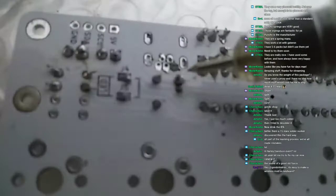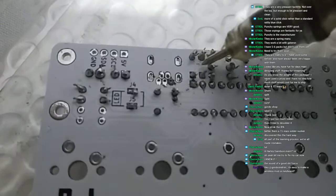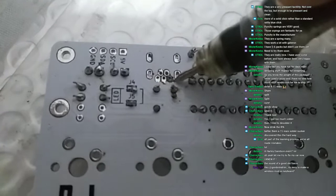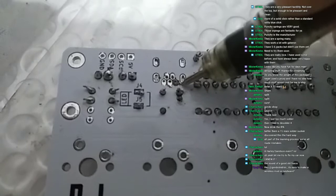as you guys should be able to see, this pad here is bust, it's lifted, right? The problem is that, and let's see if I can make this better for you guys, the tracing that goes to this pad also was ripped. You see that there is a trace here that... Okay, the camera is trolling me. You see that there is this trace here that goes here and then here, right? So it's also busted. So a little bit of the trace was ripped apart here, you see? So even if I solder this here, it won't work because this trace is broken. So we will probably need to do one or two jumpers to fix this.